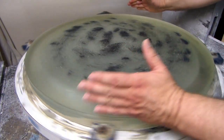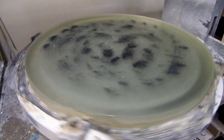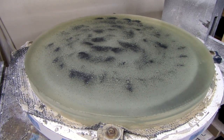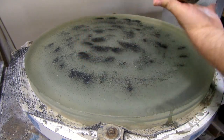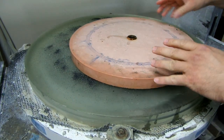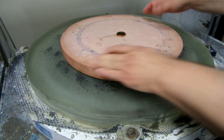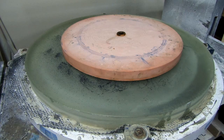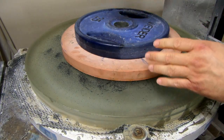When you've got a mirror this big, it's not like doing an eight-inch where everything's right there — you actually have to cover quite a bit of area. We also specialize here in ultra-fast mirrors. This one, for example, is going to be an F3.1 mirror. When you cut a curve that steep, there's a lot of glass to be removed, so sometimes you just have to use harsher abrasive — 24, 40, and 60 are grades I use quite often. I've already set this up with the overhang I want, and I'll put 25 pounds of weight on there — that'll be enough for now.